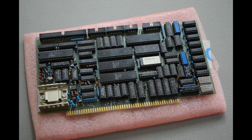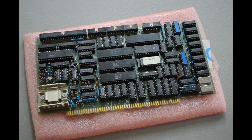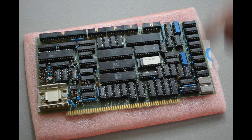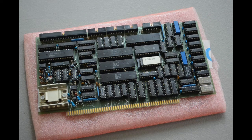I was cruising eBay and saw that, as well as all the cards and racks that go into S100 computers, there are also people selling individual cards. Back when those computers first came out, you had to buy a processor card, a memory card, an I/O card, a floppy drive card — soon you had 10 or 15 cards in a rack and the lights would dim when you turned it on. But as we got into the 80s when this board was made, they were miniaturizing things and consolidating functions into fewer chips. So this is a complete computer on a single S100 board.